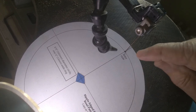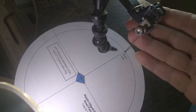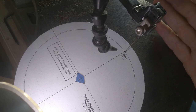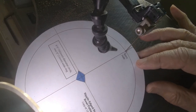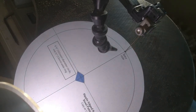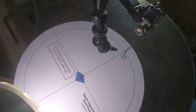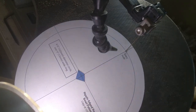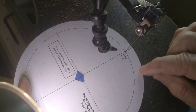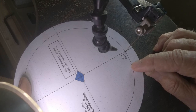I've drilled the hole at 20 degrees and reset the table to 20. I went all the way back, made sure I had a 45-degree reference, zeroed my meter, and then went to 20 degrees — I always go back to original and reset rather than just changing 10 degrees from where I was. Now I'm going to cut this 20-degree ring. She said the rings probably won't match up real well because of the angle differences, but that's okay — you're going to sand it out.